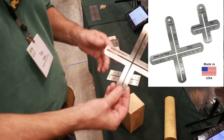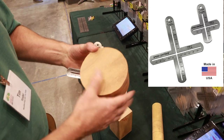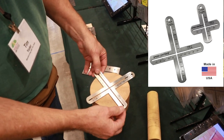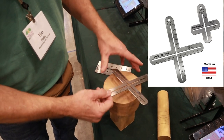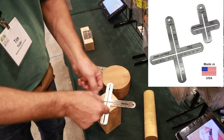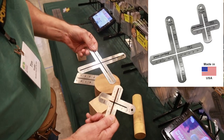This was the next thing that came out. I have a bad habit of turning something and winding up losing the dimple — I lose my center. It's round. I don't have a dimple anymore. How do I find the center? So I developed this. It has a scale on it, so if you lay it down and match up the five to the five, that's my dead center again. This was also designed so I could go corner to corner real fast and draw my axis. I make a big one and a small one.